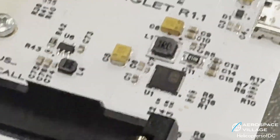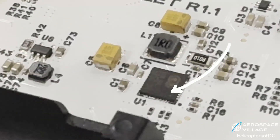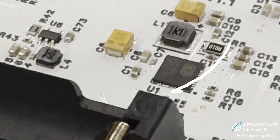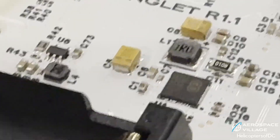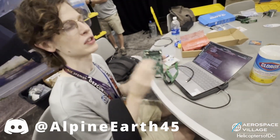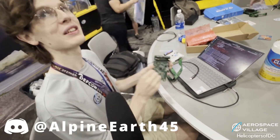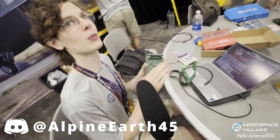A little bit of backstory: we had a bunch of issues with the BMUs — really obscure bugs where a button wouldn't work or voltage values were always reading zero in the battery management chip. It was really difficult to figure out because one prototype worked and the others didn't. It turned out the whole issue was a bad solder joint on the ground pin. There are two ground pins connected by about 40 ohms — enough to make it partially work but not fully work — so you'd get weird bugs like voltage only reading 10% of the time.